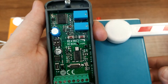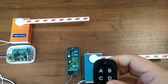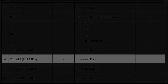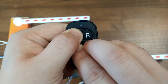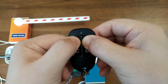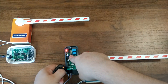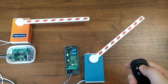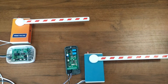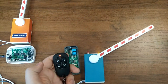Let's try programming another button — this time to emulate the CAM A TOP system at 868 MHz. CAM A TOP is 6th on the list. Simultaneously press and hold buttons A, C, and D until the flash, then press and hold the button you wish to program and press any other button 6 times. Release all the buttons. That button now emulates the CAM A TOP series remote at 868 MHz and can be paired with the CAM A TOP receiver. The Ultramax can now emulate two different systems, operating two different automation devices.